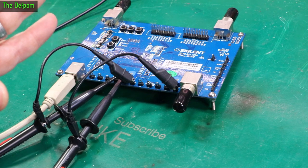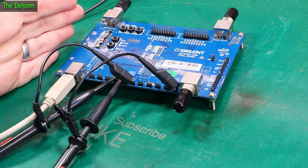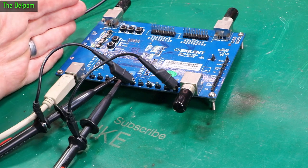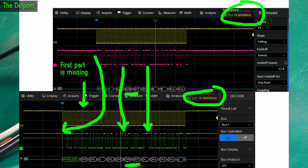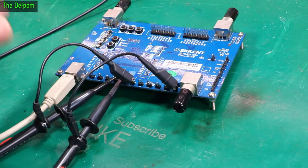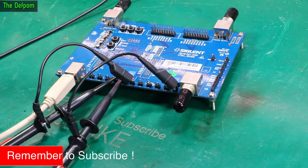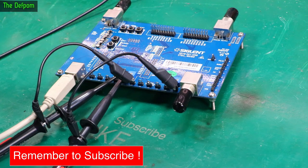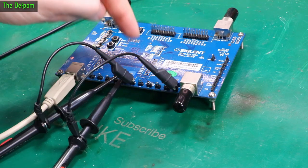I was saying before about there being a difference I could identify between what I have here and what I've observed on the forum. There are two examples on the forum where boards don't show the full 'S-I-G-L-E-N-T' — they only show 'NT,' so the first five characters are gone. There are two instances of this: one from an actual forum member with an issue, and one from a video posted in that thread showing someone else's serial demonstration with exactly the same problem. Those two boards are exactly the same version; my board is slightly different.